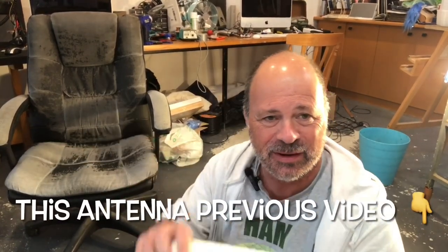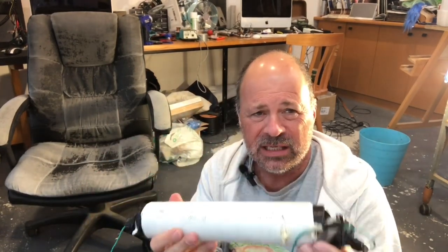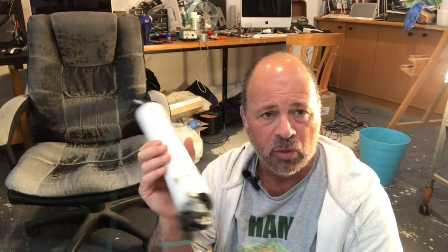Now we've dug out the old antenna. I remember when I was making this choke — it got humongous. I have a sneaking suspicion I was having issues because I had a very low power soldering iron, didn't make good connections, and I don't think this choke is actually the correct value anyway. Hanging that off a squid pole is probably not the smartest thing to do. I'll hold on to it in case I can string an antenna up in a tree. But I may play around with trying to use it as some form of loading coil.